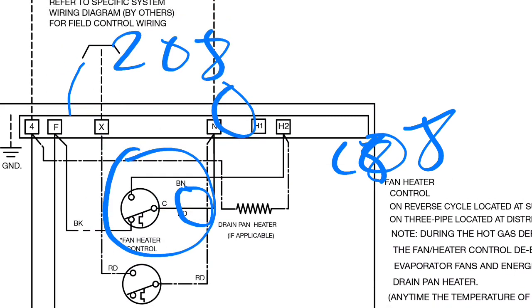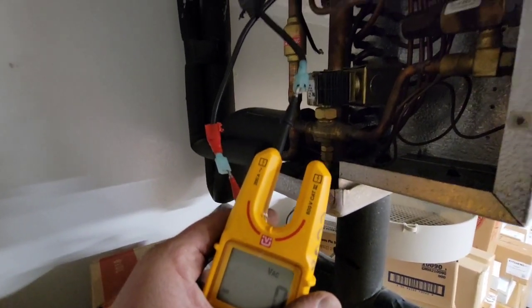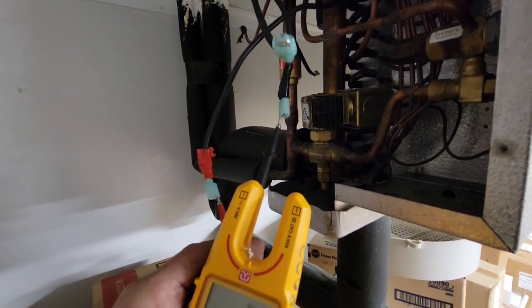In order to make the fans work, we need 208. So the common needs to have a 208-volt difference between the brown and the black wire. I think this was miswired, so we'll take the wires and see what 208 it has. Whatever one has 208 to both legs of power, we will switch that there and fire it up and see how it works. Those two have 208. The red one and the wire without tape are the same phase. So now we're going to hook up the wire with black tape as our common.